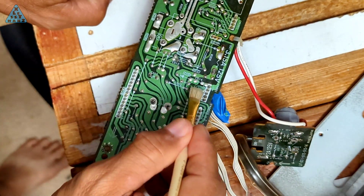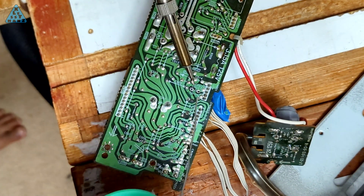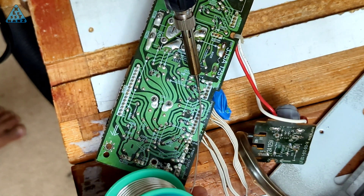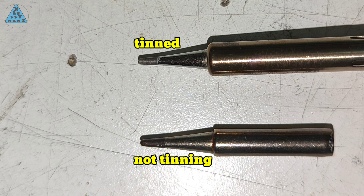The capacitor is being held in place with painter's tape. I brushed flux over the two contacts to be soldered. During some practice runs, soldering seemed simple as long as my hands didn't shake too much. I felt ready to solder the replacement capacitor. Visually it looked good enough, and a test of bending the soldered capacitor side to side seemed solid. I also found that my tinning problem might have been due to mishandling of the tip — I replaced the tip with a new one and that one tinned just fine. I'm not sure what I did to the previous tip, but at least now I'm aware of what to watch out for.